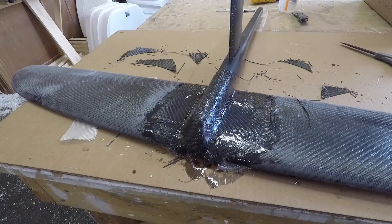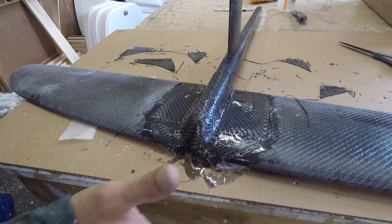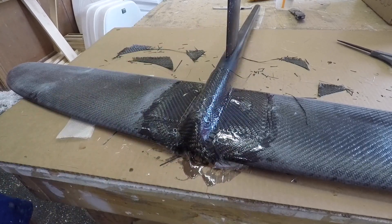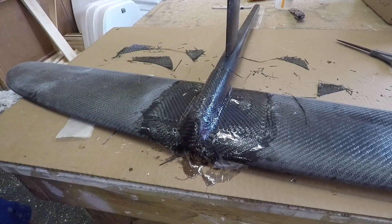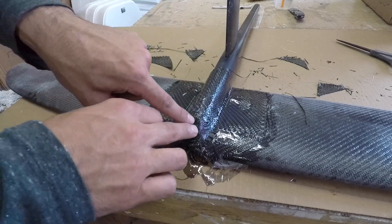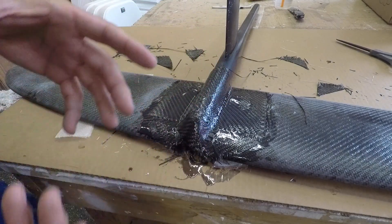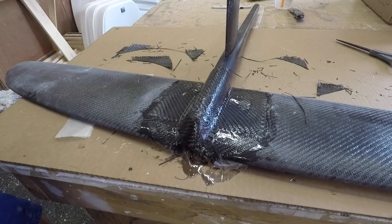What you can't see but can probably hear is I have a fan blowing air across the top of this — that's going to help take away heat so we have less heat buildup. It's really just this front area where the epoxy is relatively thick, but with air blowing across there it'll keep it from getting too hot and we'll get a clean release once it cures.